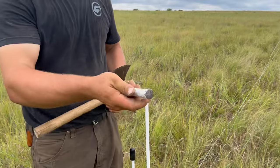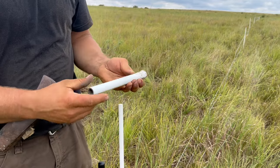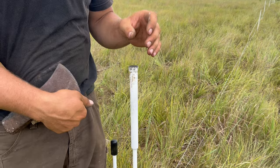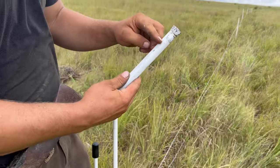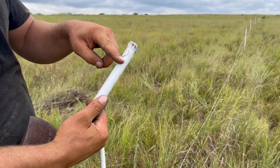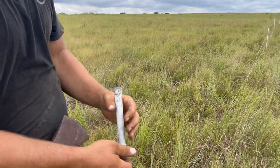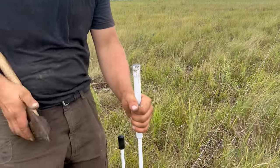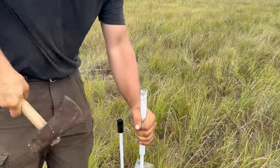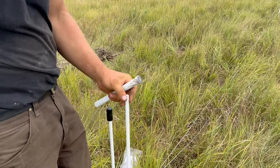So I'm going to start making these and put them on our website. It's a piece of pipe that fits perfectly on there. I cut a bolt with a perfectly square edge that goes down about this far and welded it through the sides and welded it on the end. Then you've got something to hang on to and that'll keep you going straight, and you can wail away with your big old eight-pound hammer and it won't damage it at all.